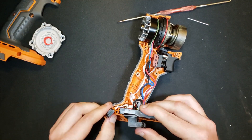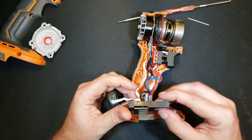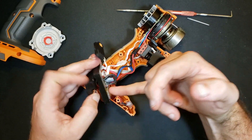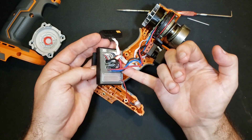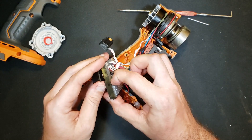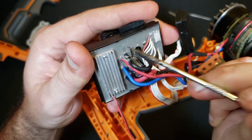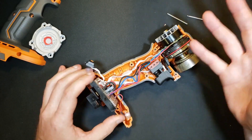This is an improvement from what I remember on RIDGIDs — having this potted, distinct module for the battery contacts looks very high quality. It has both a mechanical protection for the circuit board and the battery regulating circuit board that's down here, and a very well-done potting job that keeps it protected from moisture and possibly impact. That potting compound is actually pretty soft — the soft potting compound acts like a giant airbag for the sensitive electronics in there, keeping it safe from both moisture and impact.